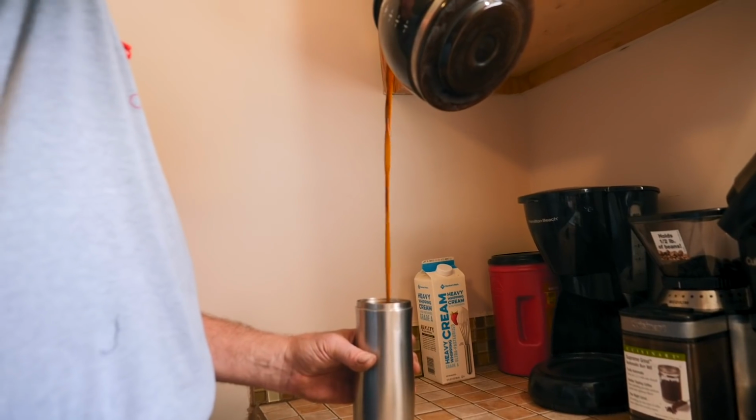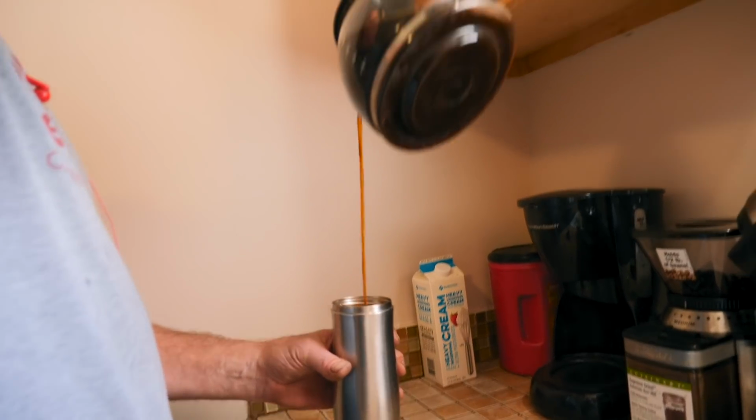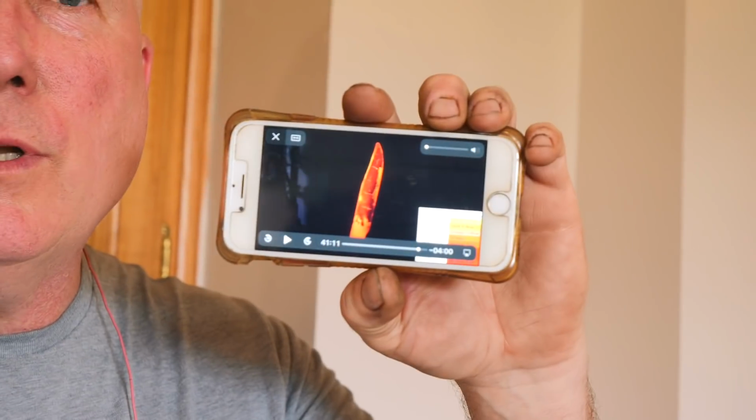Got done forging out my blade. It's straightened out. I got everything moved around where I want it. Just came in for a coffee break. I got my knife on its first heat treat cycle. I'm using the heat treat chart off the course. I did 1600, now I'm gonna do 1500 next and 1400 after that.